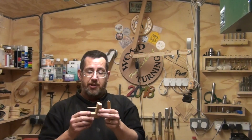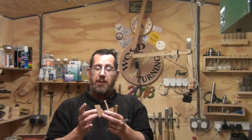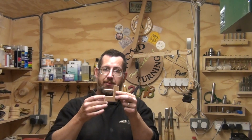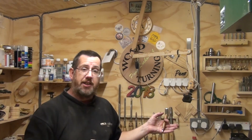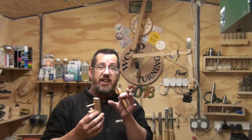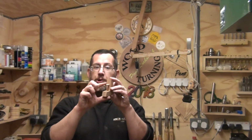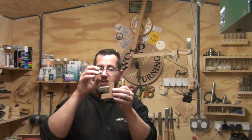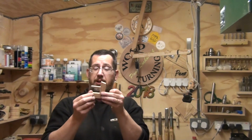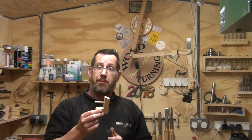The other thing I'd probably do as well, and I don't know whether it would work or not, I would probably make the base maybe a bit wider, but ideally a lot thinner, and bring this down further. My sanding disc is, I think, a 6-inch, 150mm, so your platform is at the center, so therefore you only have really the 3 inches on the left-hand side that you're using, and obviously that's going around in a curve, so you are sort of pushing on the limit of this really near at the top. So if you could get that down lower, it would have a lot more balance to hold it in place, and you could probably even clamp it to your mitre as well, so that at least that way you've only got to concentrate on holding your actual blank on there.